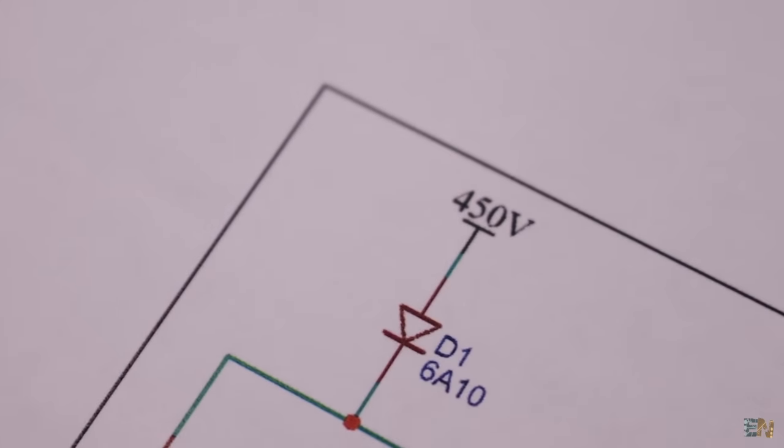To make this, you can download my 3D design from below. Remove these supports and you will be left with this support like this. And then you can make around 150 loops using thick copper wire that could withstand enough current. And once you have all the loops, you can add some Kapton tape on top so the coil will stay that way. Or if you think that is too much work, you can find these coils to buy on the internet.